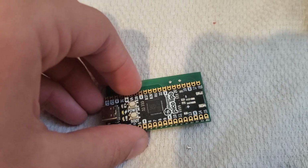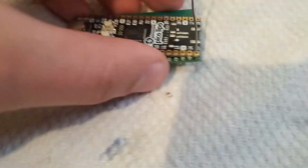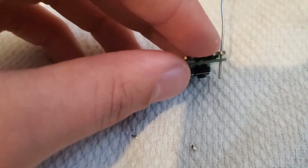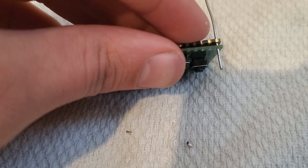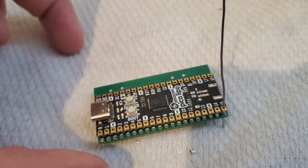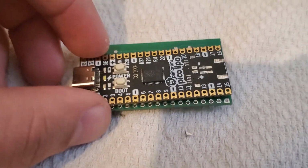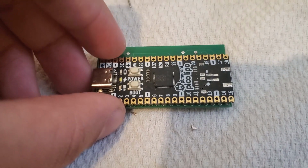And then at that point, my strategy for soldering is to take a little bit of solder, and this is kind of hard to do while holding my phone, but basically stick it through both like that, and then use the solder to take off that part and that part. And then you've got a pretty solid connection between the two boards. And you don't have to do this through every single GPIO hole. You only have to do it for the ones that are actually doing something, which is 16. So you have to do that 16 times.